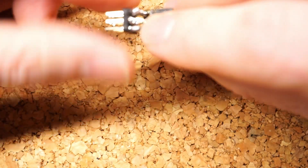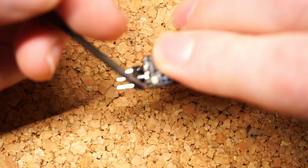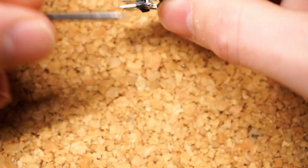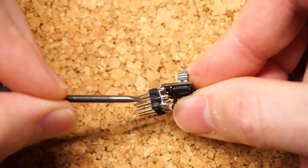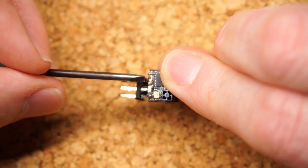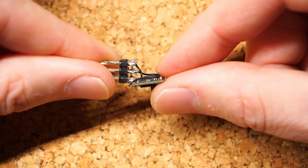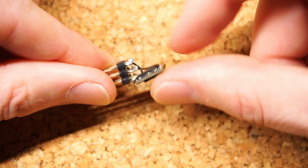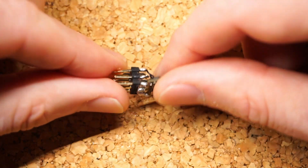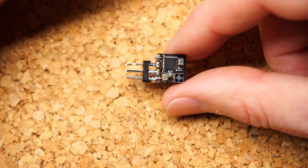If you want to build one of these yourself, here's a quick guide to what I did. The ground pad from the EP2 is ganged to one pin. Then I took the five volt pad and ganged it to the middle pins. The TX pad is my first output, the RX pad is wired to the second output, and the boot pad is the third output, dragged to the third pin. There are two other pins on the ESP processor that we can use to give us five outputs total.